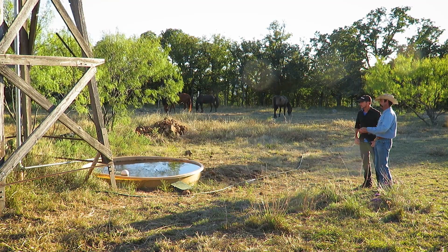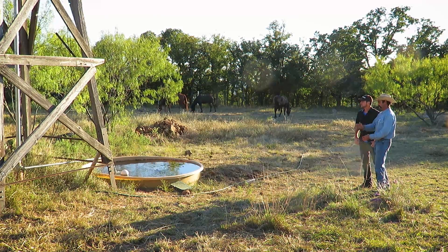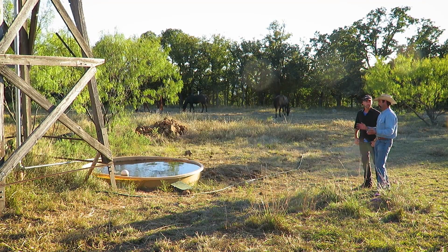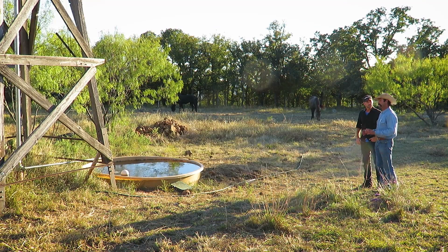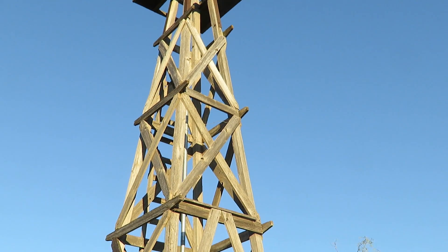When you hear and see that, and everything's pumping — everything's pumping correct on this. If there's a lot more air coming out than water, that means we're losing ground, losing water, and it's sucking air. We may possibly have to go in there and lower the pipe because the water in the well may be subsiding, going down. Sometimes after large rains it'll come up a little more. On a smaller type ranch we try to do as much work ourselves as possible. Just turning that thing on and letting it run on a weekly basis keeps everything in check.